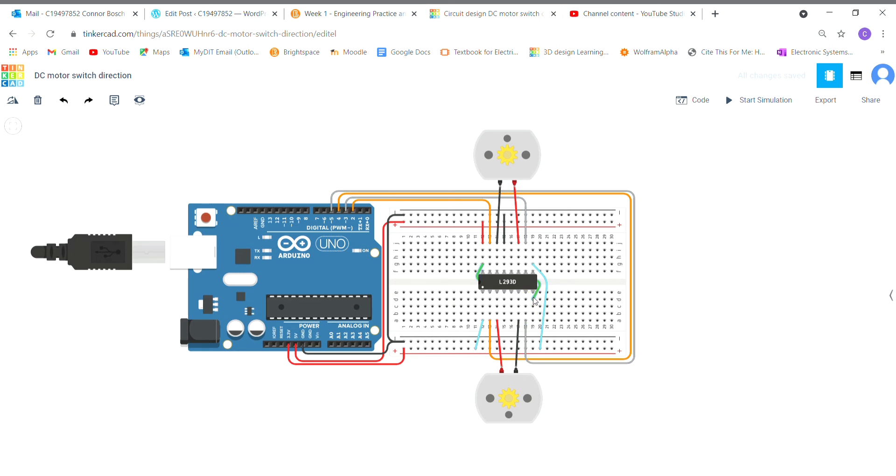The VS pin is connected straight up to the VCC pin on the 9th pin of the H-bridge, and that's connected straight up to the 5 volts bus. Input 4 pin is connected up to D2 on the Arduino Uno. The motor pin is connected to the output, the ground is connected on this side — so only one side of the H-bridge is connected to ground — and the other side of the motor connects to the other output pin. The last input pin is connected to D3. I have the 5 volts bus up here, the 3.3 volts bus coming straight from the Arduino, and my two ground pins.